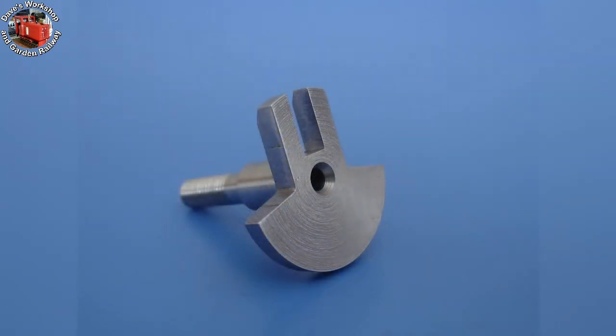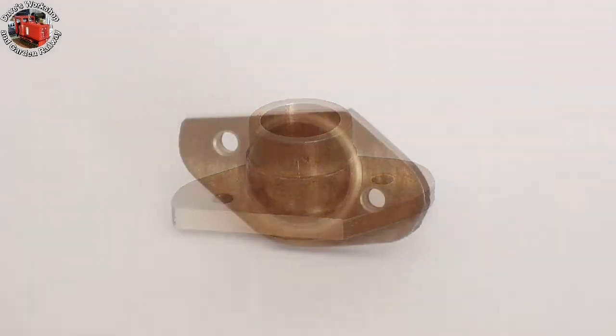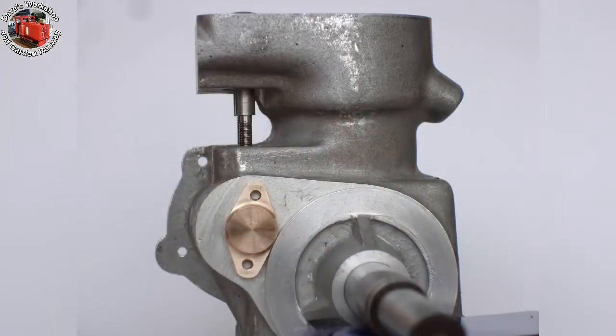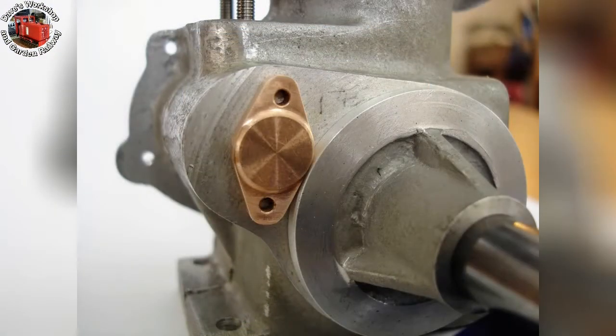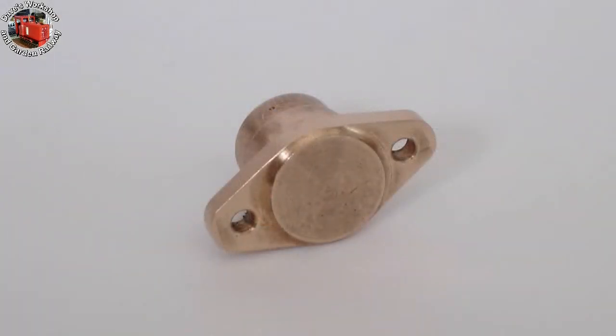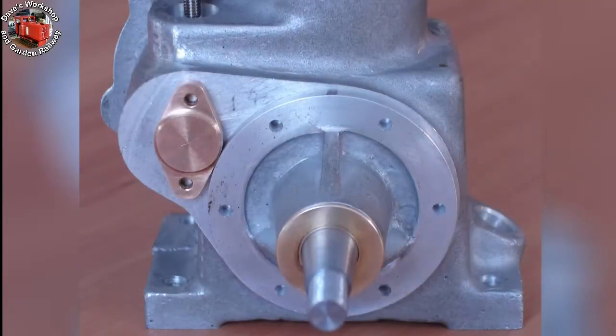That's the oil hole, straight down the middle. This previously finished front camshaft bearing needed a lot milling off each of its four sides in order to be able to fit the main bearing housing — here it is reduced until it just fits. The valves are in position too, just a whisker of clearance. The finished bearing — all the turning was done 30 years ago. A lovely bronze casting with the oil hole at the top. Crankshaft in place too.